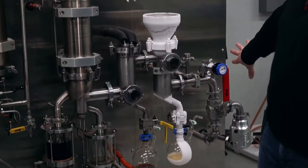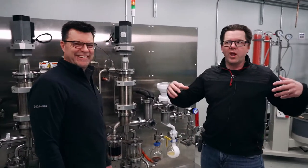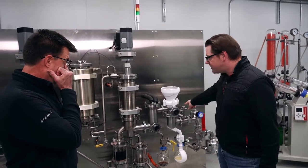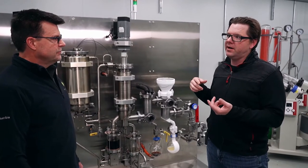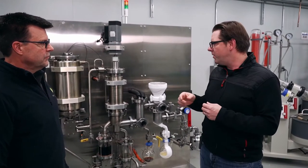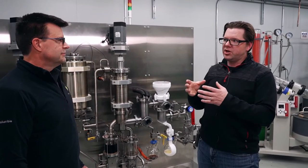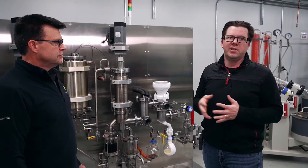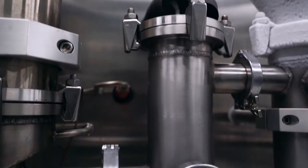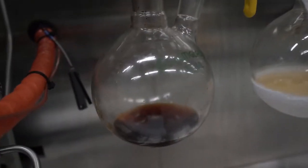This section is the vacuum conditioning system. When you go down to really low vacuum, you want sensors so you can confirm you're at the right vacuum level. On this system, we add in all the trending data, so if you're troubleshooting a vacuum leak you can pull up the HMI, see the trend, and identify where the system is not holding vacuum. There are two cold fingers — this is a recirculating cold finger — and you can see condensate forming from the vacuum flow.